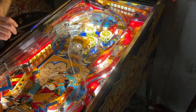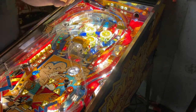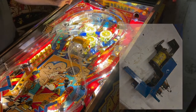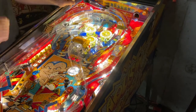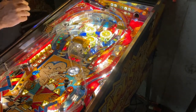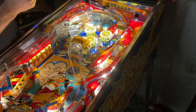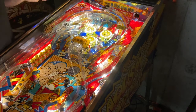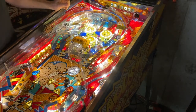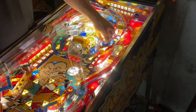The mouse traps — there's one here and one there — were super dirty, so I took them apart and cleaned them really well. Before I took it apart, I noticed part of the housing was cracked quite a bit, and in the process of working on it the crack got a lot worse. So I had to do some repair work to close up the crack, and I added Lexan splints around the whole housing using hobby-grade super glue to reinforce it — that should never be an issue anymore. All the bands were replaced with Titan silicone bands.